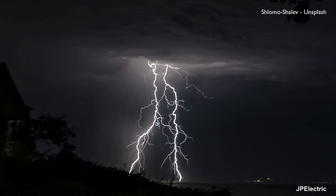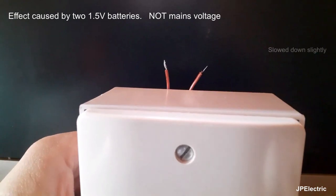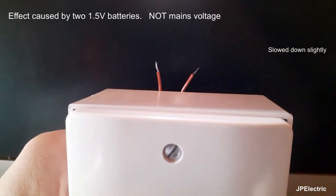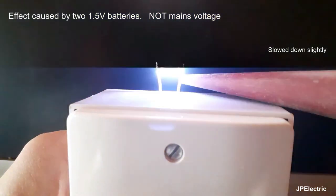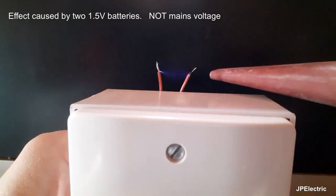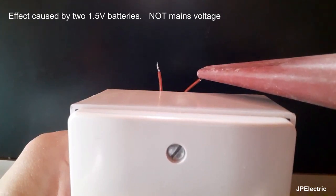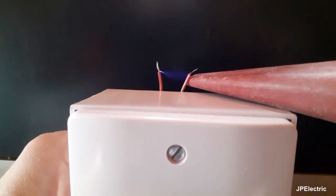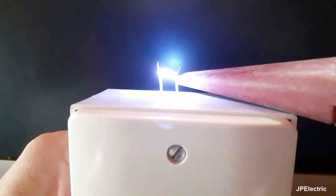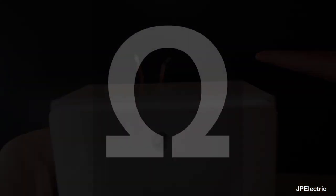A good example of a voltage overcoming an insulator is lightning. Eventually the charge builds up so much that the air itself conducts electricity. Here's an example of a high voltage starting to conduct through air — when the conductors are a certain distance apart current won't flow, but as I push them together you can see the current start to flow between the two points. We obviously don't want to use too much voltage when doing our testing, because you pump too much voltage through any insulator and it will eventually fail — and if it does fail, it can do so with catastrophic and lethal force. So insulation is vital, and the testing of insulation is vital as well.